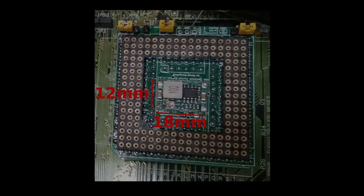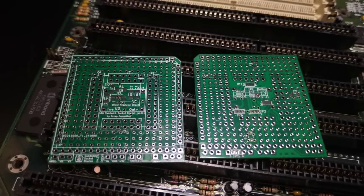I've also added solder pads for a modern linear regulator circuit based on the AP7176B chip which can be used instead of the mini buck converter. Ok, let's put it together.